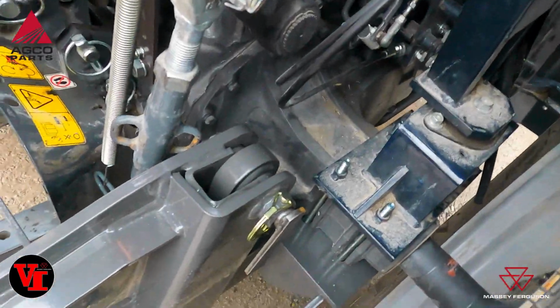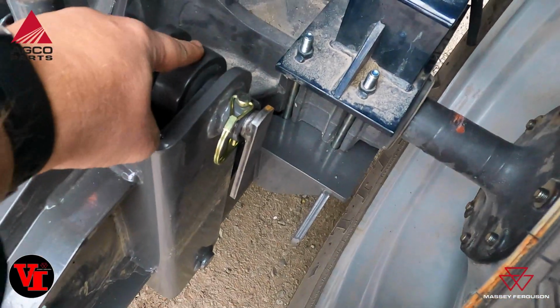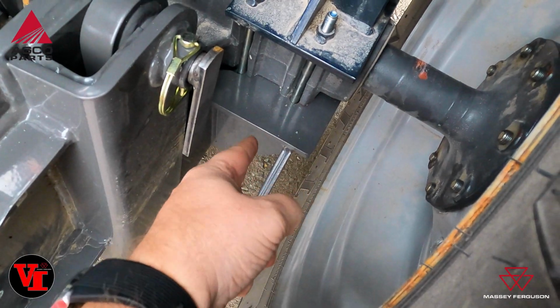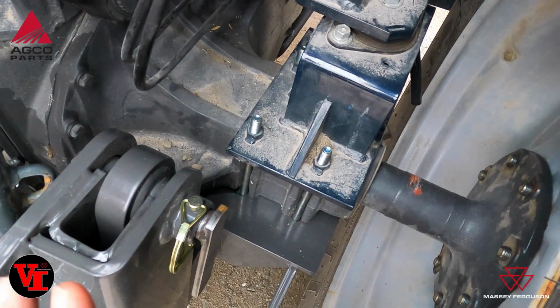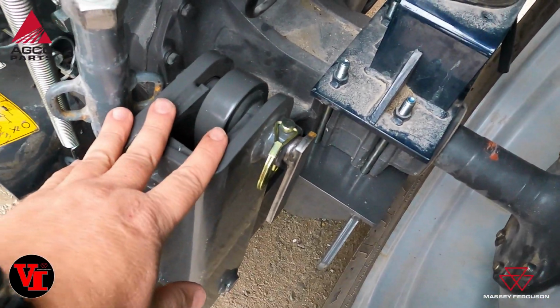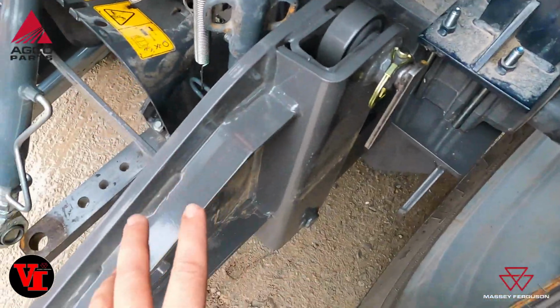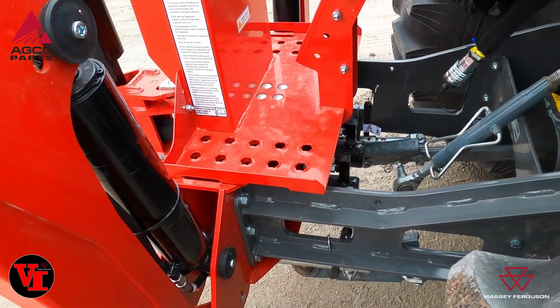Part of the backhoe, this is a subframe mounted backhoe. This part here is actually part of the tractor, and the framework you can see down here, and then the frame rails go on up underneath and connect to the loader chassis. This part, this Y here, and all this down here, and this part here is going to stay with the backhoe when you take it off.